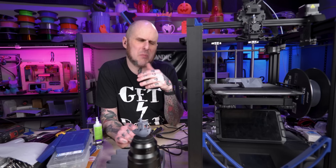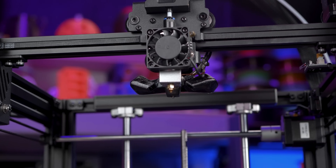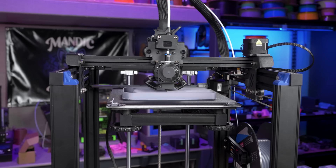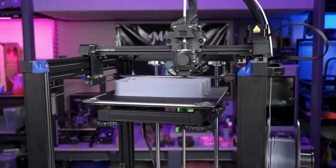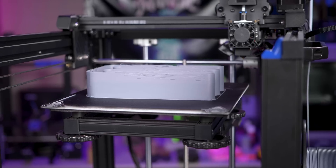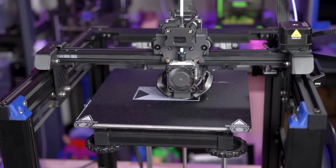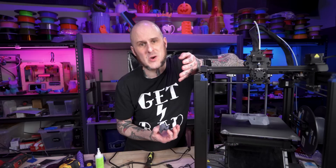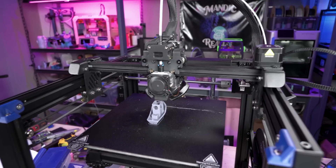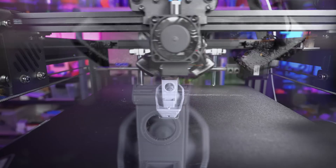Now comes time to actually lay down plastic, but before I can get really fast prints down, I need to know what this machine is capable of. It has that proprietary Creality nozzle with the longer heater block like Spider hotends have. The first thing I did was lay down a flow rate test — a racetrack that runs at increasing speeds as it goes up, which I created in Orca Slicer. From this testing, I narrowed in at about 15 millimeters cubed per second on this hotend. That is better than a standard Mark 8 hotend but not quite as good as a Volcano. Armed with that information, I followed my standard tuning steps and started laying down real prints. Of course, the age-old question is how fast can it print a tiny boat — so I laid down a Benchy using Inland Grey PLA Plus. This thing printed in just about 28 minutes, breaking the 30-minute Benchy barrier. Are there faster Benchies? Absolutely. But I still think that's fairly impressive for the first print I did with this machine.